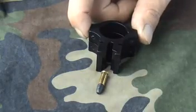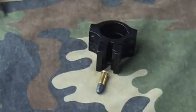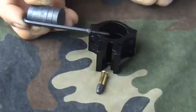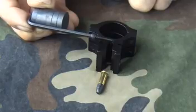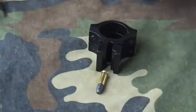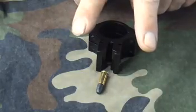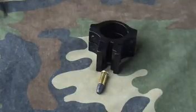If you find the clamps are just a little bit too narrow, all you need to do is take one screw out, pass it through a threaded part on the clamp on the reverse side so it bears against the opposite side clamp. That in effect opens it out; you then fit onto the rail, remove the screw, and simply clamp up like that.